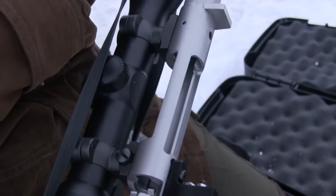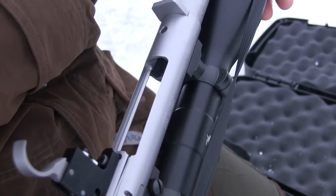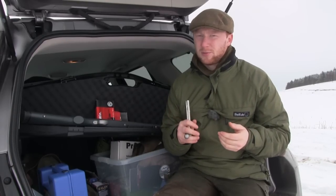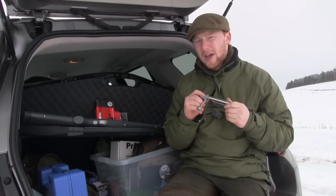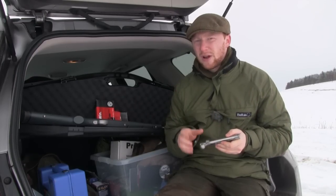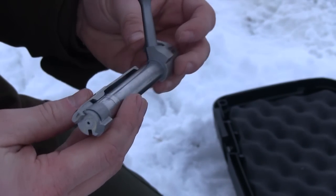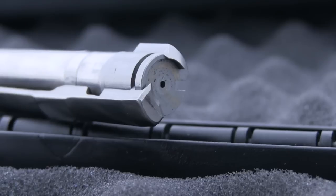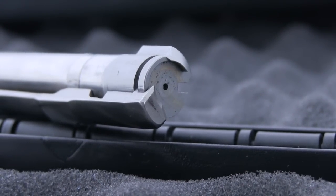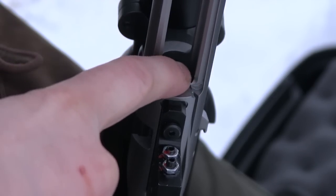The action that Kimber use is a combination of the Mauser 98 and the Winchester Model 70, but what they've done is stripped it down to the very minimum tolerance possible for each caliber bracket. What that leaves is a very lightweight yet strong and reliable action. Taking a closer look at the Kimber bolt, you can see the fixed claw extractor. The ejector is a fixed blade which is inside the action, and if you look on the face you can see the slot where it comes through.